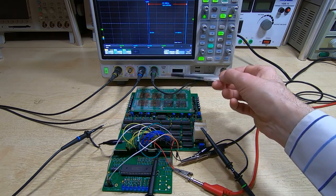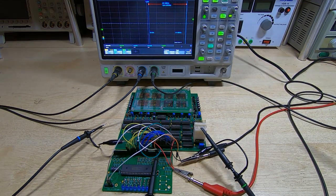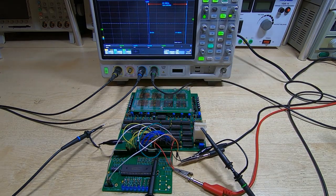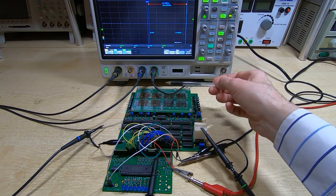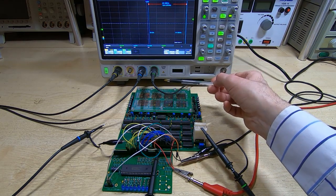And that means if for example we take the X0 and Y0 drivers and turn them both on, then the combined current is not necessarily going to be the same as the X0 Y1 combination. That means that we already have 256 combinations just for the combined currents for the select drivers. We then have another 8 drivers for the inhibit, and again they will introduce variability as well.